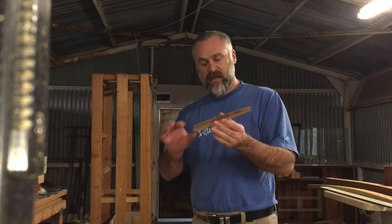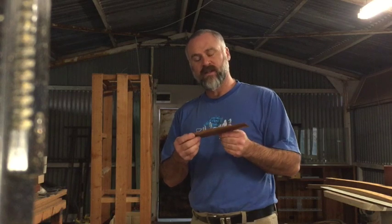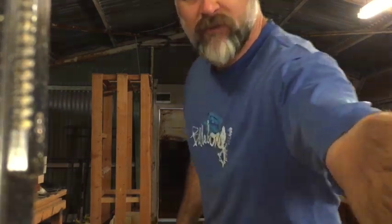I've finished sanding up my laminates. There are three parallels, one taper, and these here are the wedges — I've made two of these, one for each limb. On top of those laminates I'll have a half-millimetre Tasmanian blackwood veneer, then on top of the veneer on the outer surface you've got the clear fibreglass. They're in the oven at the moment — I'll just show you the oven.